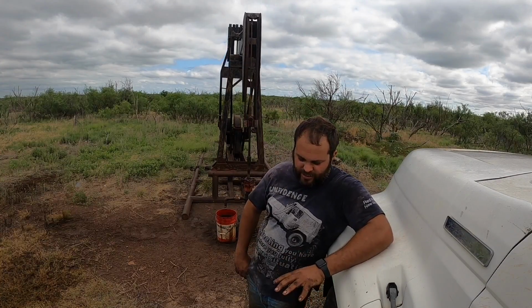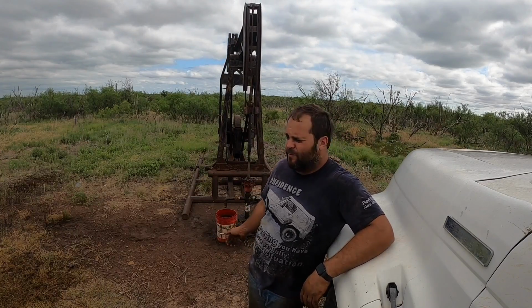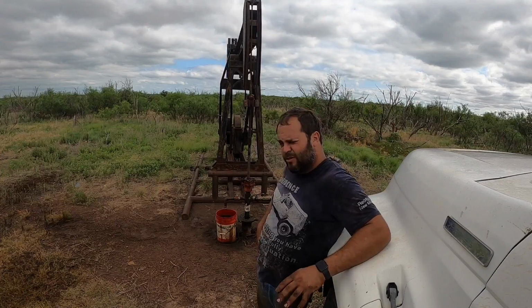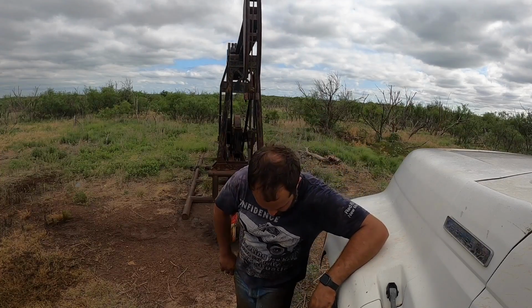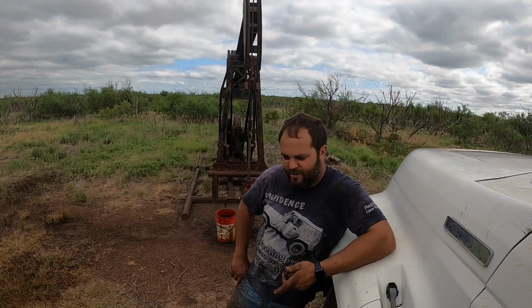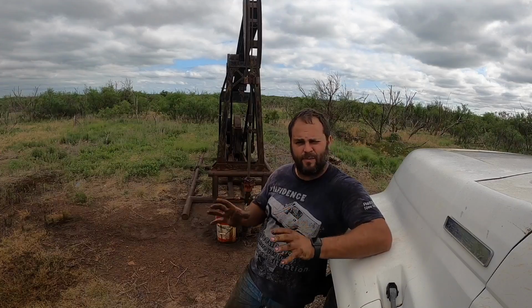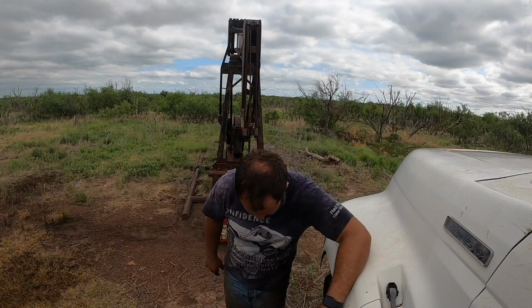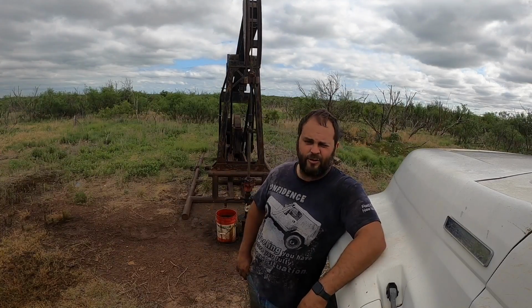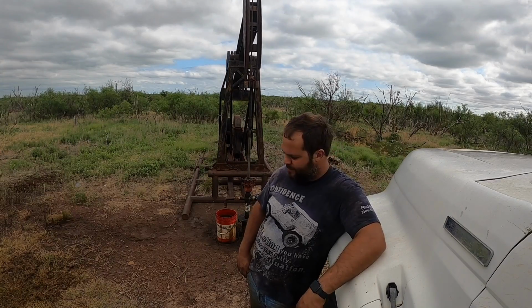Anyway, if you dug this well and you had a 3 or 4% oil cut, it's making probably 25 barrels of water, maybe 30. It's making more water than I expected. So if it makes 30 barrels and it's 3%, that'd be almost a barrel. It's probably making about a barrel a day, more or less. If you dug a new well and it came in at a barrel a day, you wouldn't be very happy with it. I mean, that happens.